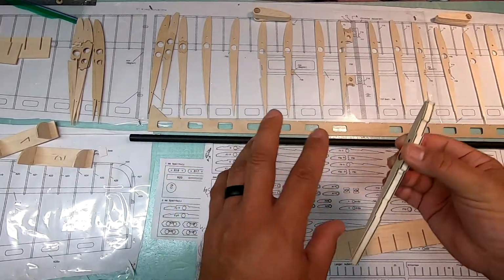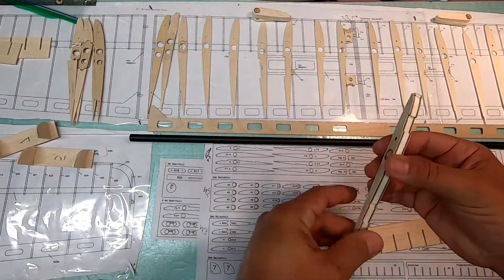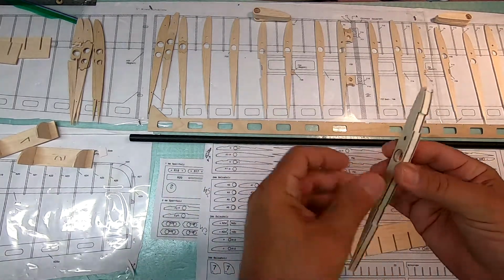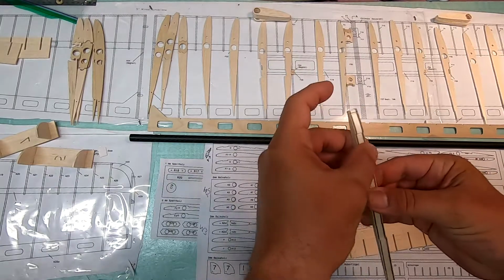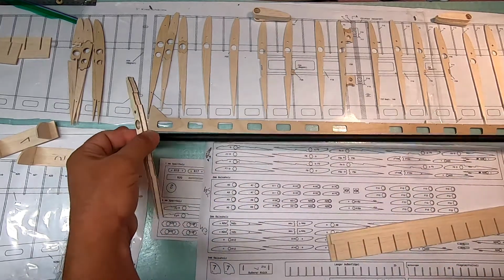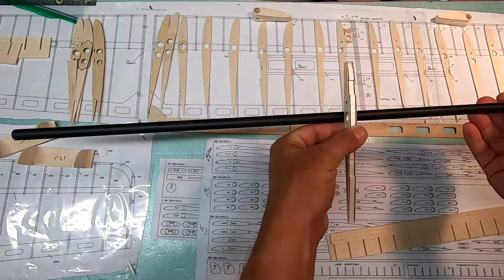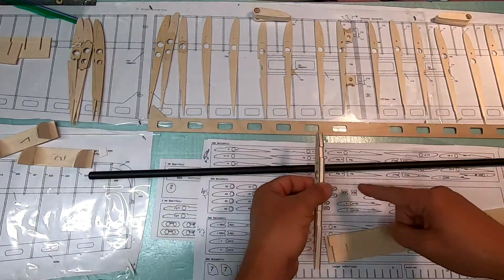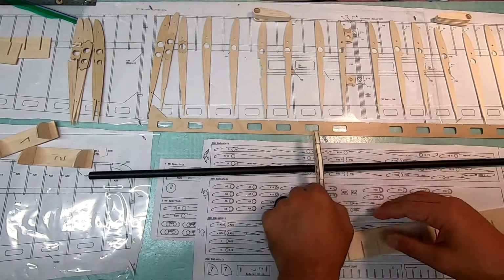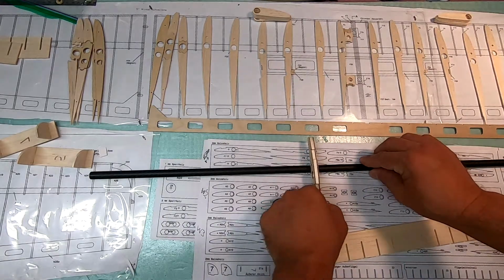If you follow the plans that are available, and they are very, very thin, there's a lot that is uncovered in them, in my opinion. But again, there's a lot lost in translation, I'm sure. You want to get the middle of the spar. You're going to end up trimming the outer edges, but you put this onto the spar in the center, and then use a triangle or T-square or other precise measuring device to make sure that you have a 90-degree angle, that this is not offline.